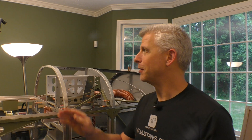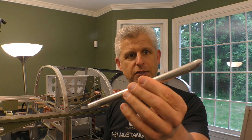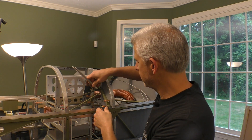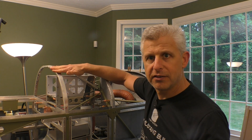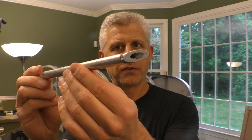The telescoping tube technique for locating where the down tubes pass through the upper D skin wasn't actually all that accurate. I thought it was working out great, but in the end the left and right didn't match symmetrically, leaving me wondering which one was right. So I came up with a much more accurate technique: I took a single piece of aluminum tubing and cut the angle exactly as it fits into the tube. I placed the skin over it and drew the oval shape — because when you pass a tube through at an angle, the opening is an oval. When I did that on both sides, the result was completely symmetrical. I now have a high degree of confidence that these are the right locations, so let's cut those holes in the upper D skin and see how it fits.